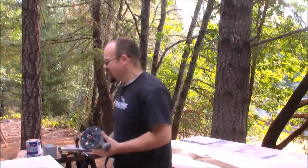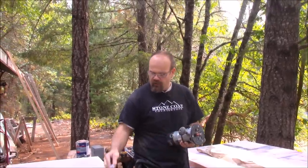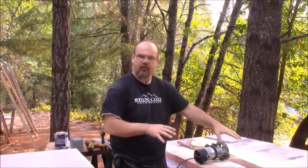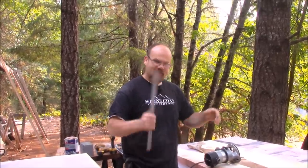This is also really important when you're doing any wood slab. You're going to have cracks, weak points, and places the slab wants to come apart. If you put square tubes underneath your slab it does a couple of things — whenever you slab a piece of round wood or a tree, it wants to cup and bow on you. This is your prevention. You can spend hours getting it flat and perfect but you want it to stay put. If you don't do something like this, the wood will still move over time and you'll be disappointed. Use this trick — you'll love it.